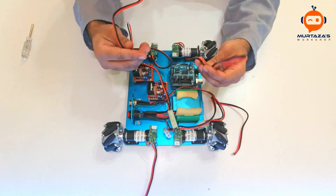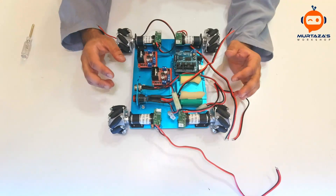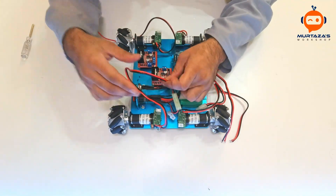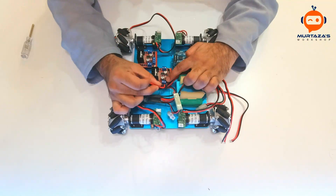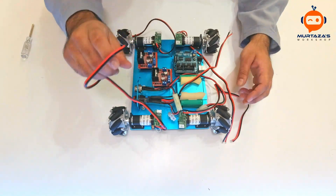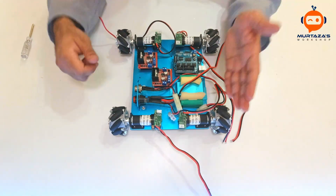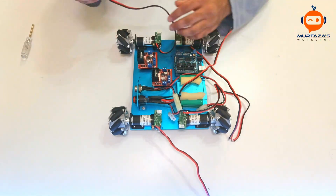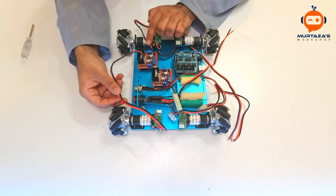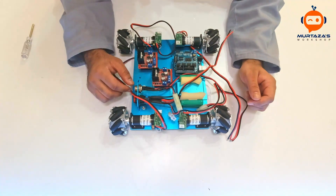The idea here is that we want to shorten these wires, but not too much, so that we can use them later on. We have two wires for each motor that will go to our H-bridge. You can see here we have point A and B, and then point C and D — these points will be connected to the motors. We can keep one side for one H-bridge and the other side for the other H-bridge, so this one will be connected here and that one will be connected over here, and then the same way we will connect the other motors.